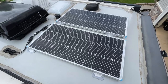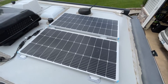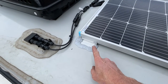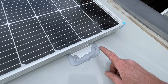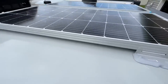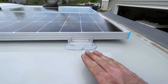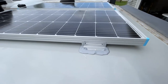Here's the finished product up top. This isn't a super in-depth install video, but what I did was use a stud finder to locate the studs, marked them with a sharpie, and hit the studs across the front. Instead of one screw on each side like the brackets are drilled for, I put both screws in the front because they hit the stud. In the back, the roof starts to taper off, so I positioned the brackets where it made sense — I'm less concerned about the back being structurally ridiculously rigid, since if it's going to catch wind it would catch it more on the front end going down the road. I hit the studs on that row, so we're rock solid.